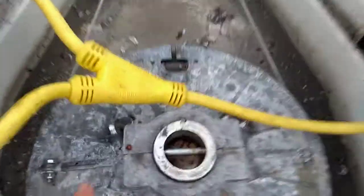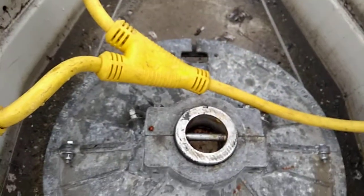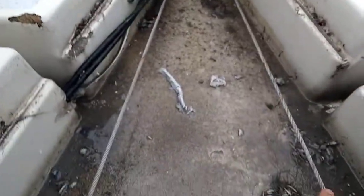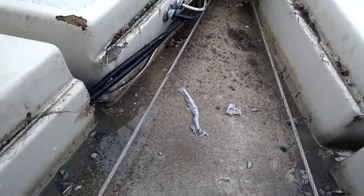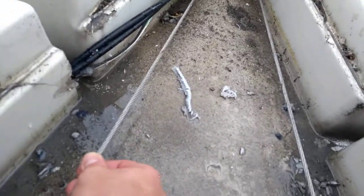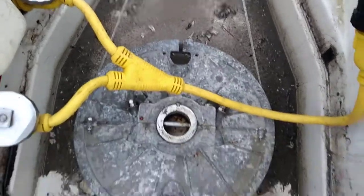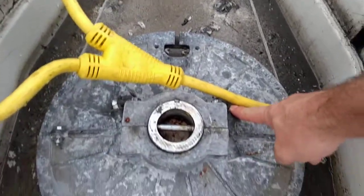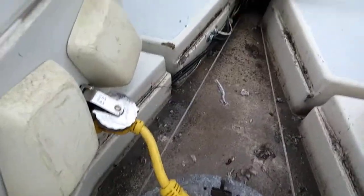If you loosen the cables — which you do right here at the quadrant — there's a nut and bolt, and those go to pad eyes that run back. That'll loosen the cables. Regarding cable tension, you should find these cables are just a little bit on the slack side — plus or minus half an inch, right at the margin for how much slack you should have. If the cables are slack, tighten them up. If you want to get the whole works apart, loosen up the nuts and bolts at the pad eyes, the cables will loosen up, and then you can remove the bull gear.